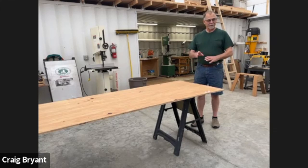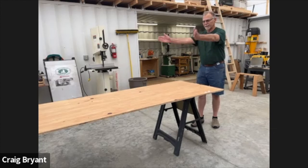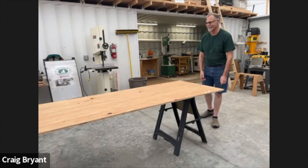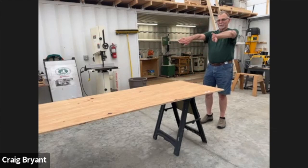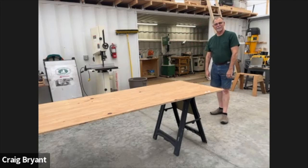even if I'm making a solid mast, I tend to cut it in quarters and glue it back together. I picked out a board that I thought looked pretty good for the mast that I'm currently working on. It goes through the table saw and does this number. What you can do is turn those pieces over, clamp them together, and they straighten each other out. So I finished gluing up the whole thing, and it's within 1/8 of an inch perfectly straight.